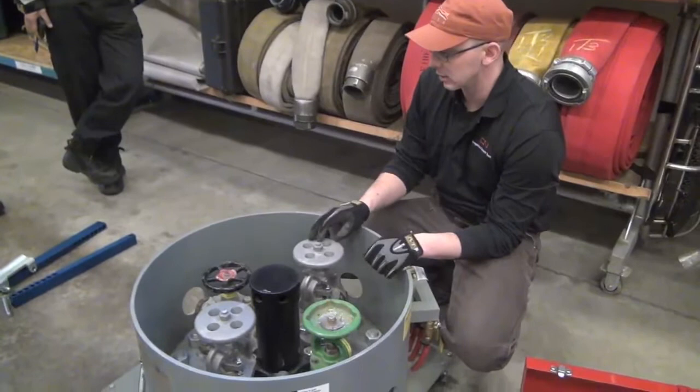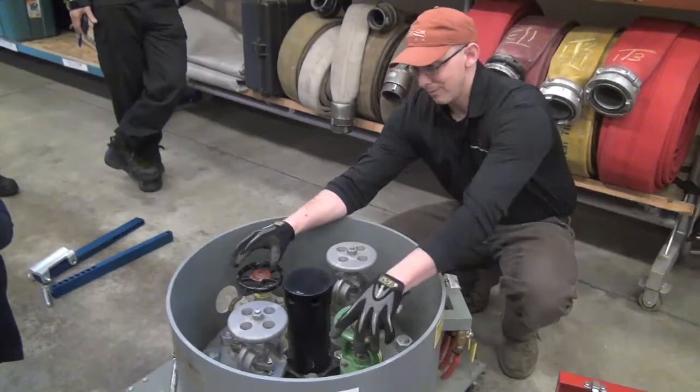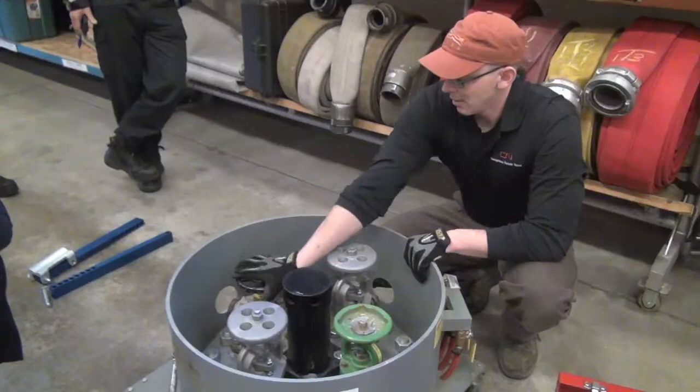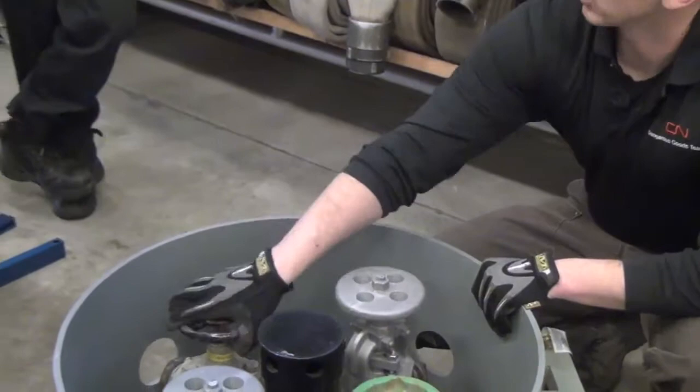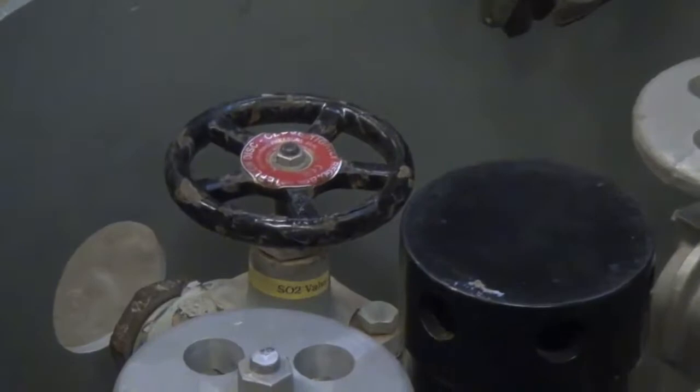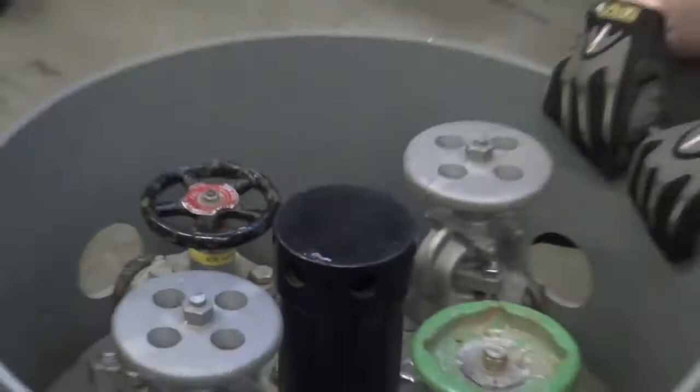The valve we put on this side of the car is an LPG service anhydrous ammonia valve - more or less just a two-inch version of the chlorine valve. Two-inch opening, packing on these - the nut is right here under the handle. Never hurts anything to take the handle off if you need access. Just make sure you don't operate it when you're doing that, then tighten the nut down. Make sure the valve is shut, plug is wrenched in tight, and then the studs down on the base.